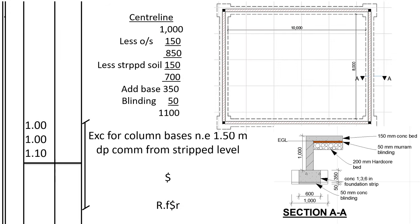Then now we shall move on to excavating the column bases. The column bases are below the columns, and we said the columns are the corners. The black parts are the corners here. They are the column bases. I am highlighting for you. The column bases are these broken lines around the columns.